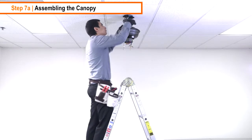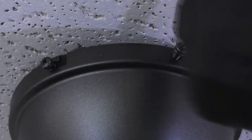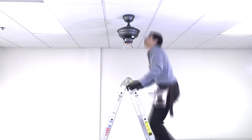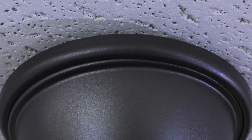After completing the connections, inspect the box and verify that there are no exposed wires, then tuck the connections inside. Assemble the canopy by sliding it up to the ceiling, aligning and twisting the canopy over the two screws on the hanger bracket to hold it in place, then insert the two removed screws and tighten all four screws. Slide the canopy ring over the canopy, then press and twist over the tightened screws to lock the ring into place.